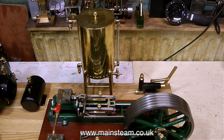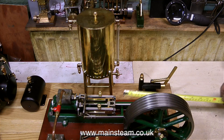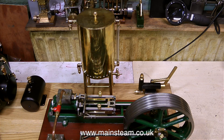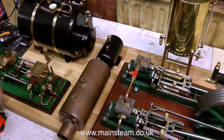When trying to find the relative positions you have to imagine the plant is in steam and you need to get at everything. It makes sense to group like parts together — the water pump and the water tank very close together. I also need it to be where I won't catch my hand in the flywheel or touch any hot steam pipes, so around the corner is a good place. And the main water pump — the steam pump — needs to be near the boiler.